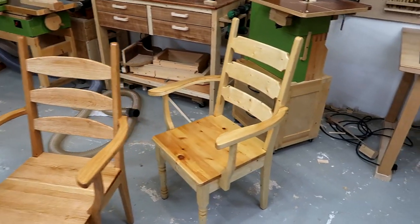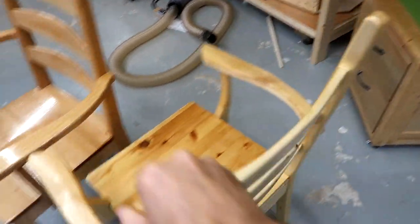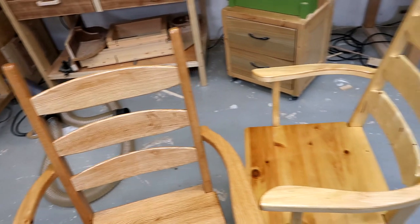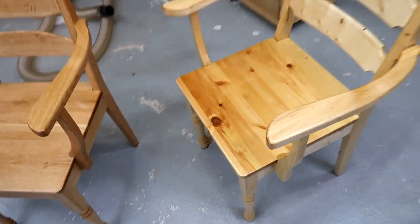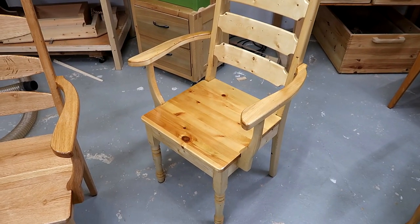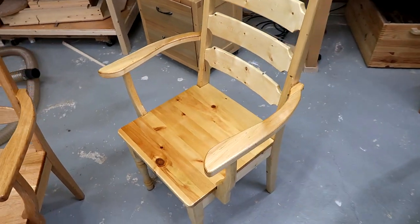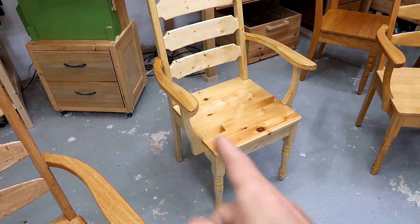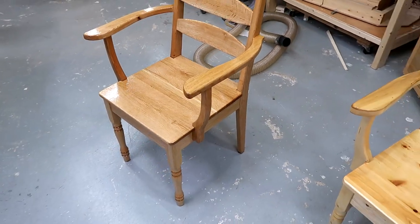My favorite of the chairs I made is actually this one, which I thought of as a bonus chair. I started by just cutting some back rungs on the bandsaw to show you don't necessarily have to bend them. Then I thought, since I already made the rungs, why not just cut up a 2x6 for all the other parts — that way I could practice before putting the nicer ones together, making it a lot less stressful since I was using inexpensive wood. And actually, the kids really like this chair. I think I might make more, because the way it's made, it's more than strong enough — this is a very sturdy design.